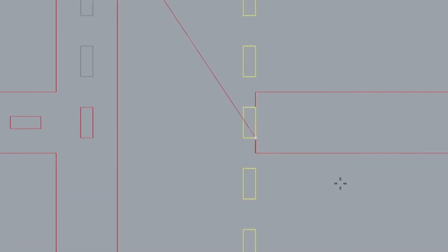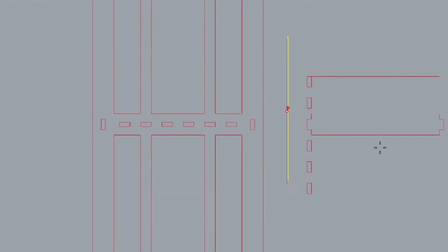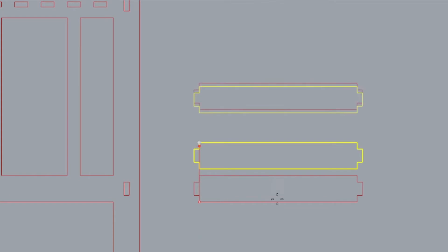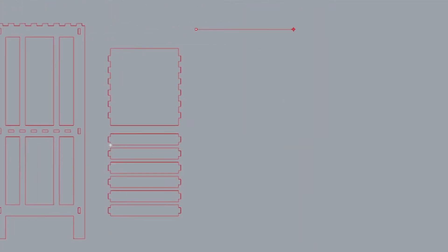When the frames were complete, I moved on to designing the interior shelves and structural support panels. There will be two interior shelves in this project — one at the base of the end table and the other at the center. The structural support panels will hold the decorative side panels together. All of these components come together using finger joints and slots, which takes a lot of thought because each joint and slot needs to consider the thickness of the quarter-inch plywood, which typically isn't exactly 0.25 inches — it's a little bit thinner.